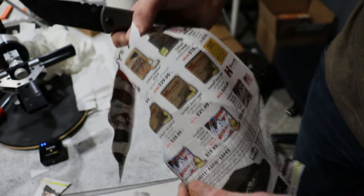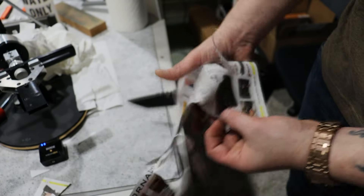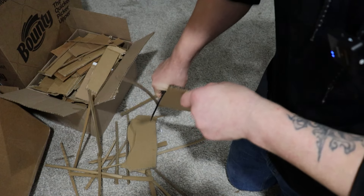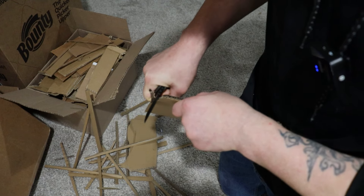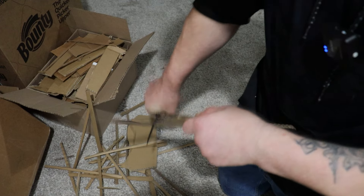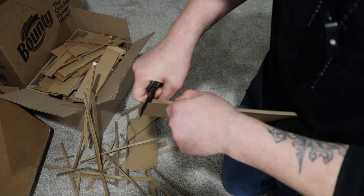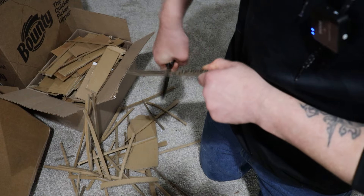Also, there's a right or left-handed bias with the cutting. This would be a right-handed knife because it shows the flat side on this side; if it were opposite, it would be a left-handed knife. For regular EDC use you really don't see much of a difference, but when cutting wood or food you do. High levels of sharpness, great cutting performance, and slightly better edge retention because the geometry is thinner — it doesn't have two sides, so it's a little thinner behind the edge.